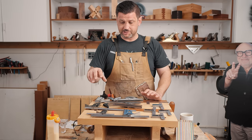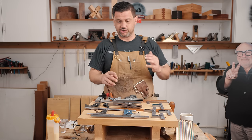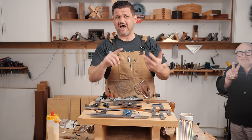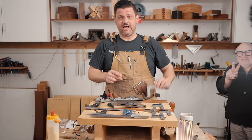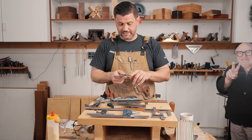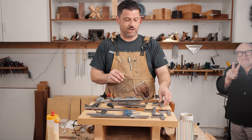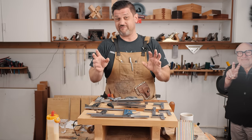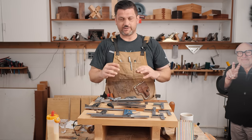I've got lots of squares here. We've got some Starretts, which are always rated the best square but also the most expensive. Precision Engineering is always considered the best value — a mid-priced, high-end square — and they also make the squares for Mitutoyo, Lee Valley, and Brown & Sharpe. We have some T-squares, and some square kits that come with center-finding gauges and compasses, and then I have a layout square. The first thing you should always look for in a good square is that the numbers are laser etched into them, which means you'll feel a little divot when you run your fingernail across it. We've got about 20 to 25 different uses for squares we're going to bang through.